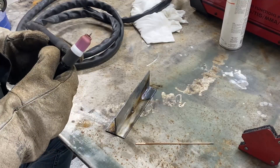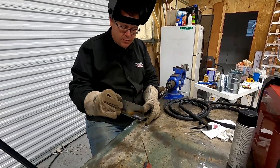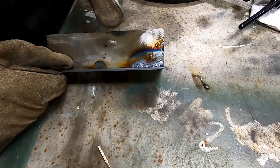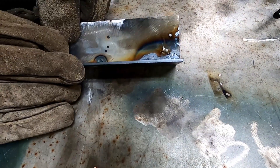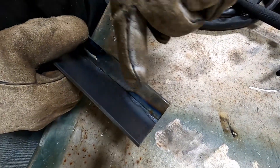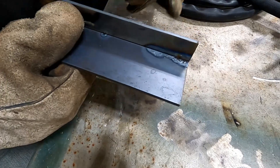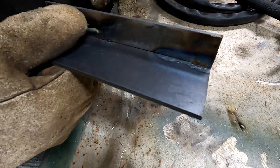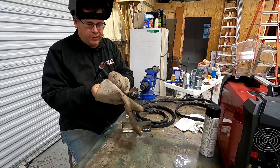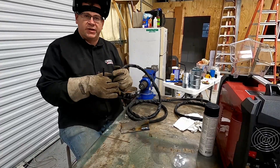I'm going to stop there — I touched my filler rod to my electrode and I'm going to have to re-grind that. I do have a sloppy bead but I do have good heat penetration, maybe a little too much. On the back side I'm not seeing a fill in between the two joints, so let me re-grind and give it a try again. I've got my tip sharpened on the grinder — we're going to start kind of where I left off, and I won't forget to turn my gas on this time.